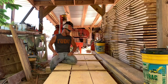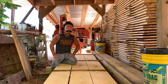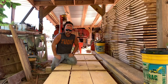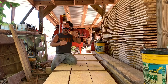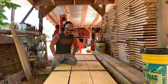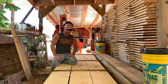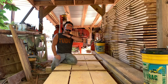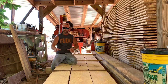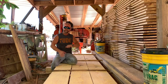What I was going to share with y'all is when stacking this stuff, I use 1-inch by 1-inch sticks. If I'm going from 1x10s or 1x12s on the bottom and I'm going to stack 1x10s on top and I could possibly get them with the lull — when I change lumber I might put a 2x in there, that way the forks on my lull will slip between it. Then I can just pull the 1x10s off the top and then the 1x12s or whatever. I try to put these sticks 36 inches apart and keep it straight and level. You don't want it twisted, because once your lumber dries it'll be twisted. Keep your foundation under these stacks as straight as you can get them.